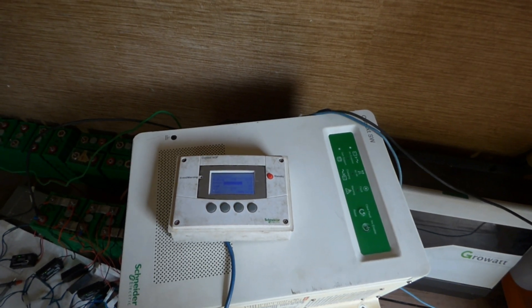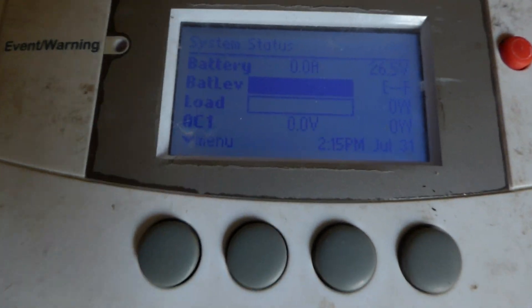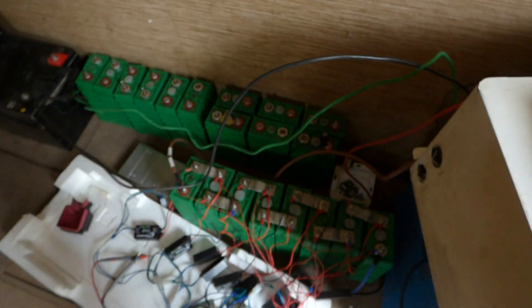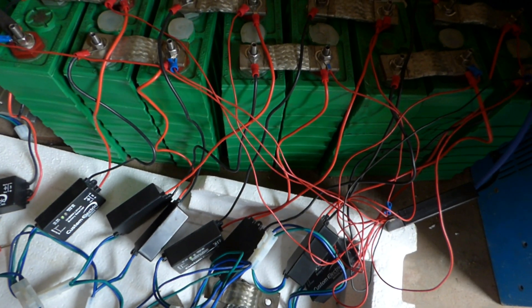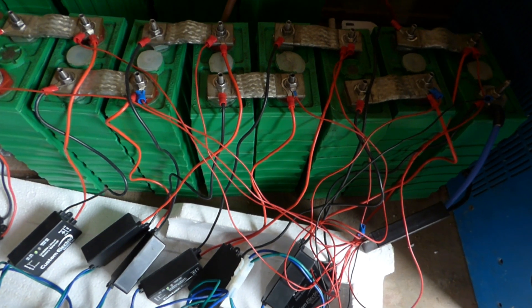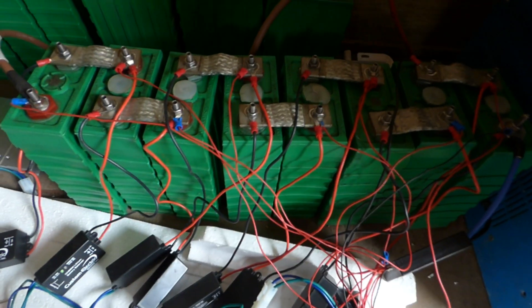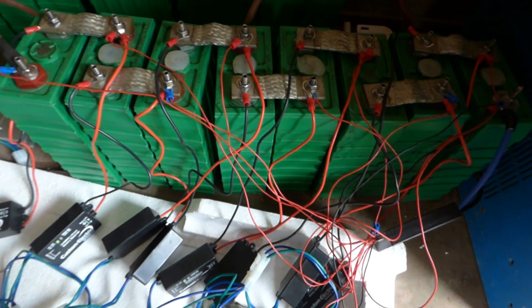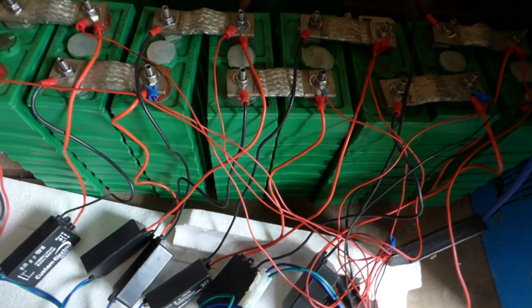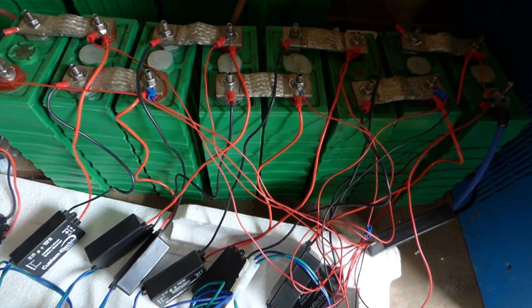This video covers a period of two days. As you can see from our SCP system control panel, it says the battery is full at 26.5 volts. Here are our LiFePO4 batteries that we've struggled with. Yesterday, if you recall, it triggered the over-voltage alarm and then powered the inverter off. So what we did was discharge it using the AC, which was pulling about 1100 watts. We discharged it, it dropped to 20 volts, we took the load off and it came back up to 25, and then we ran a drill on it. After five minutes the inverter powered down again.